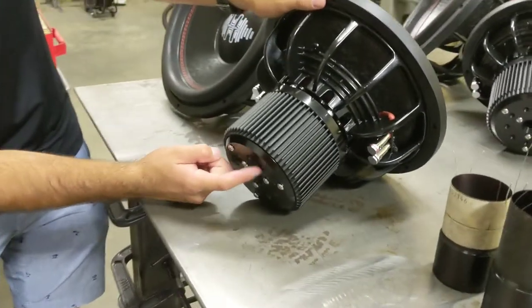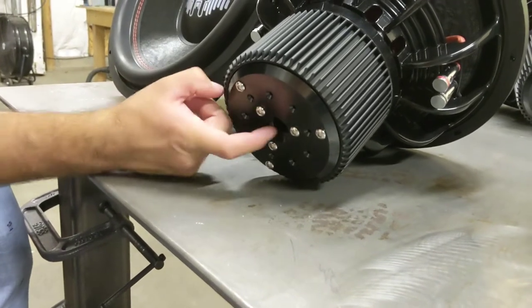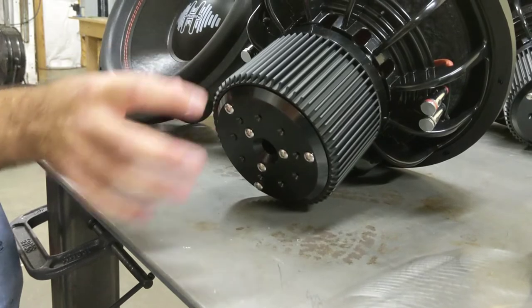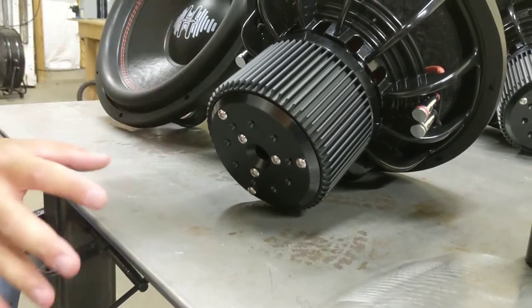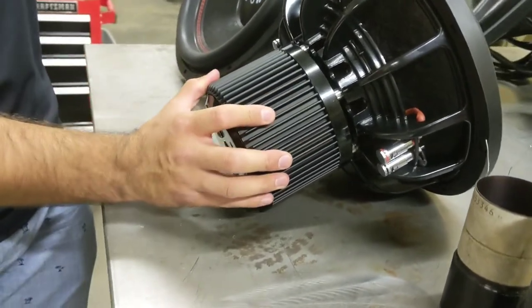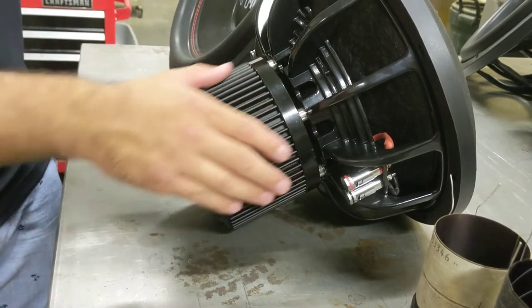On the bottom of the motor, it features our high-velocity cooling vents. These are right underneath the voice coil location as well as a properly designed center pole hole. These exchange the hot air inside of the subwoofer with the cool surrounding air around it. On the outside is our extruded aluminum black anodized heat sink, which sheds some of the heat coming through the motor body itself.